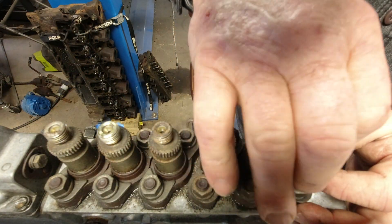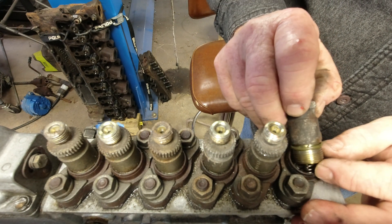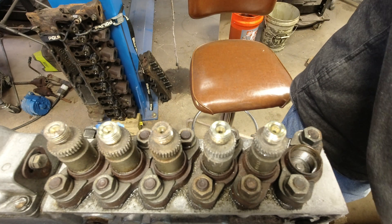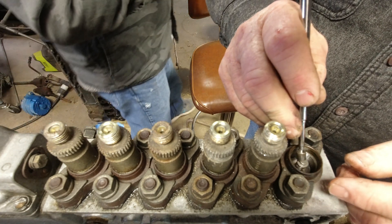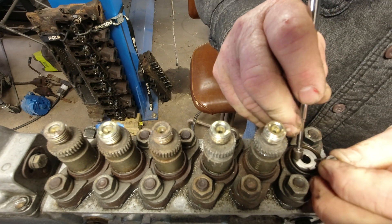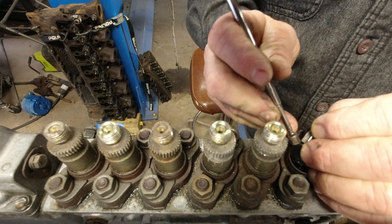Alright, that's got the hard muscle part — breaking them loose anyway. Got to hope you guys can see, I'll try to stay out of the way. You're going to lean these things over and grab that spring — you don't want to drop it. This spring right here is separate, and then you'll see there's the delivery valve.